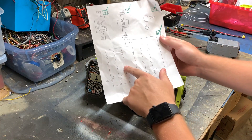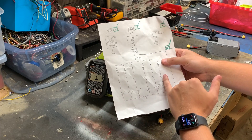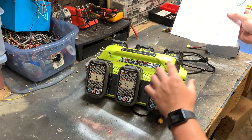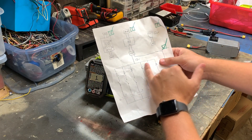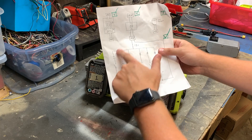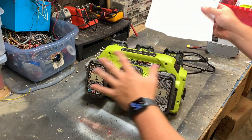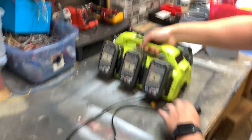That's why these switches are here. I have individual switches, which I like because I can select which battery I'm pulling from — more on that later. All it then does is use blocking diodes, so if this battery's switch is closed and that battery's switch is closed, this battery cannot charge that battery. They are all still fully retaining their charge.